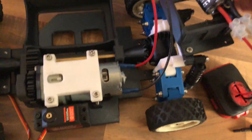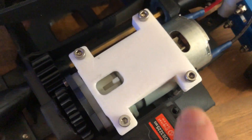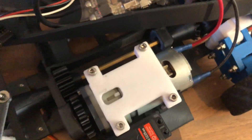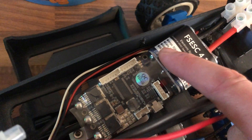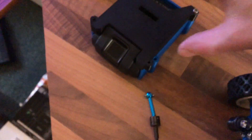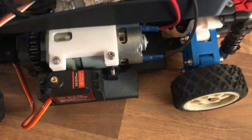For the electrics — the most exciting part — we've got a typical RC receiver and a FlipSky VESC. I'm not sure how much power this motor is going to pull, and honestly the wires are a little thin for this, but it'll do for a test. I'm using this VESC because it can handle 3S to 13S LiPo — 8 volts to 60 volts — so the 18 volt drill battery is going to be fine. I do have another DC ESC but it's not really up for the job.